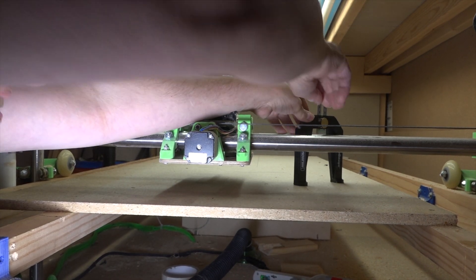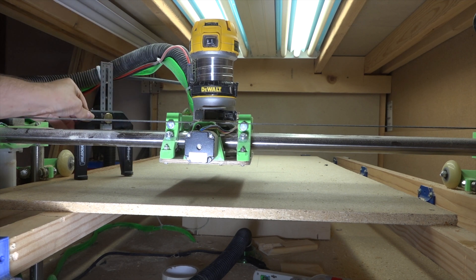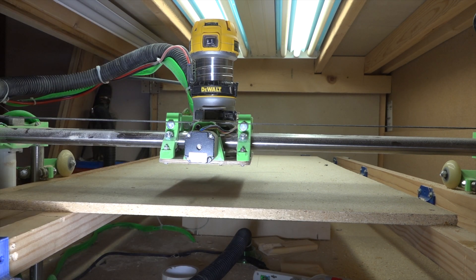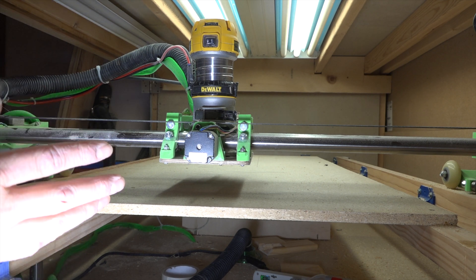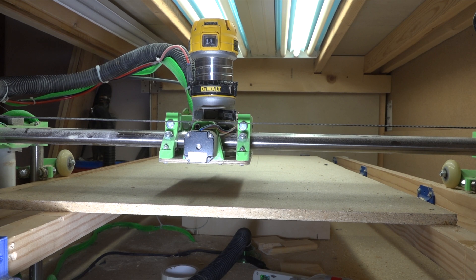Right now it looks like this needs to be readjusted, but it's just a matter of making the measurements, making adjustments on the little height screws, re-zeroing the axis, and measuring again. So that covers the areas I had blurry footage on previously. If you have any questions, let me know. If you have better ideas for doing this sort of thing, share them — I'd be interested in hearing other approaches. Thanks for watching and we'll see you next time.